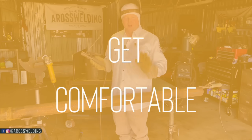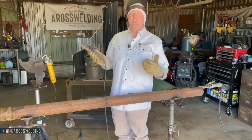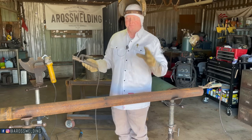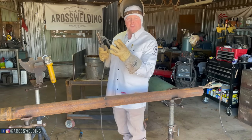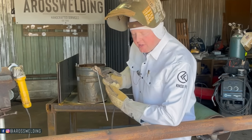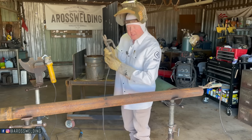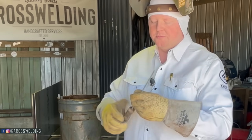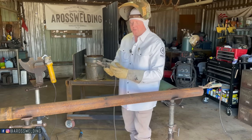That's very important. We hear it all the time with all these welding videos, and those of you that are just getting into welding or in welding school, get comfortable is one of the biggest things that I can recommend, because there's 14 inches between your stinger and the end of your rod on most welding rod, and sometimes whenever you're new, that's real uncomfortable. So if you need to put it pointed down like this, if you need to point it out like this, or if you're doing overhead, you need to point it straight out. Do whatever you got to do to get comfortable to weld on what you're welding on.